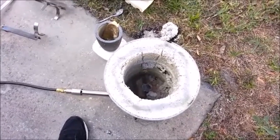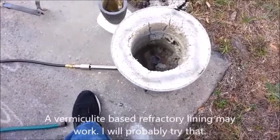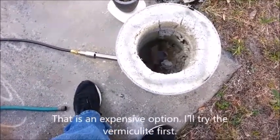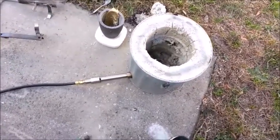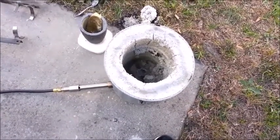But if I stick to melting aluminum, I think it will be okay. I may be able to line it with something — that's a possibility. I could line it with better refractory, or I could just rebuild the whole thing with kiln bricks. That piece I used for a new plinth down there is pretty much untouched — it just sat there and took the heat the whole time. I've got a lot of broken kiln bricks and might be able to incorporate them into it.